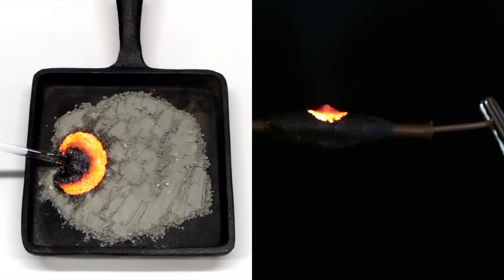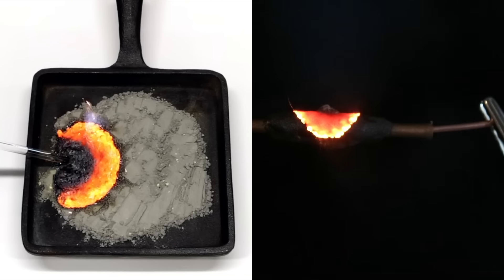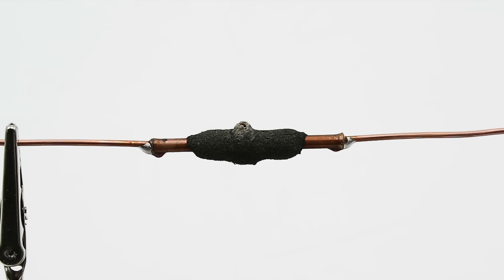There also isn't any information available on what's actually inside this pyrotechnic composition, though I can make an educated guess. There is a very common chemical reaction used in chemistry classes to demonstrate exothermic reactions: the reaction between iron and sulfur. This mixture is actually so volatile that you have to be very careful while mixing it because friction can cause it to go off, and typically it is ignited in a laboratory setting using a red-hot glass rod. From this example, the two reactions appear nearly identical, and a further piece of evidence is the strong smell of sulfur given off by the sleeves — the reaction between sulfur and iron produces ferrous sulfide, the black crusty material, and the gas sulfur dioxide, which would account for the smell.